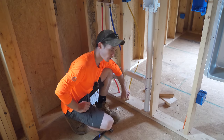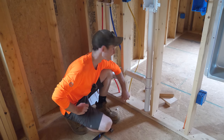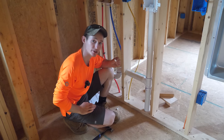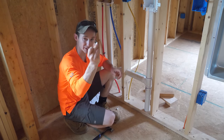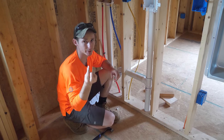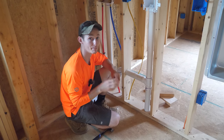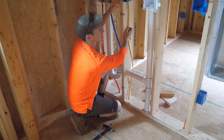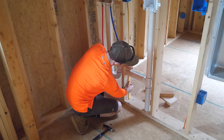In general, we're shooting for the middle of all the studs and plates when we're putting our wires in. Code minimum is an inch and a quarter — any closer than that, you need a nail plate. We're nailing with these little plastic staples. These are the ones I like best personally because there's no risk of damaging the cable like metal staples can do if you're not careful. These also have two individual tiny nails, which I find are easier to drive than the singular metal staple. It's one staple within 12 inches of the box, then every four feet minimum after that. I'm leaving about six or eight inches hanging out of the box as well — that should be plenty for wiring up our devices.